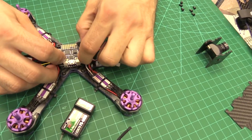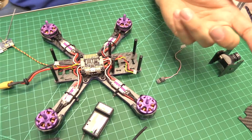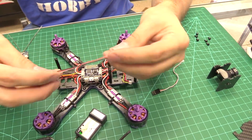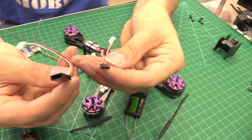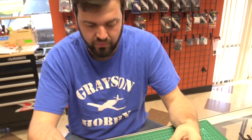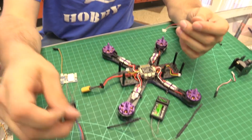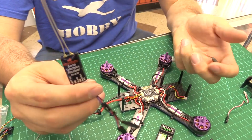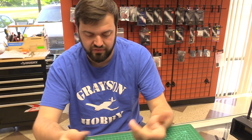Unplugging the factory cable doesn't help because you still don't have a cable to plug into the board. So for only a couple bucks, we have an adapter here. This side is female, this side has male pins. The adapter cable allows you to run SBUS or PPM on the Wizard's SP Racing F3. Anyone using the SP Racing F3 board can use this adapter to run the X6B or the Spektrum 4649 without any soldering.